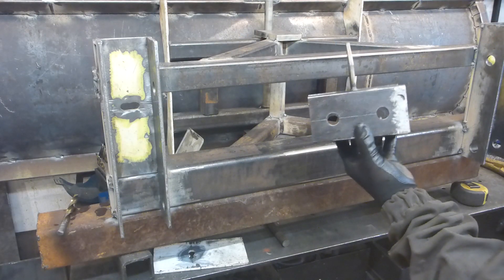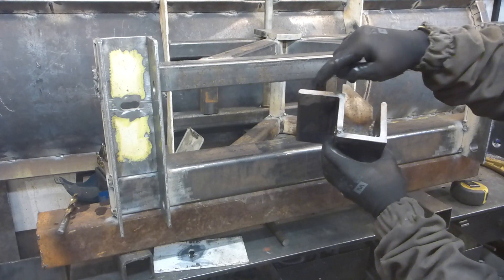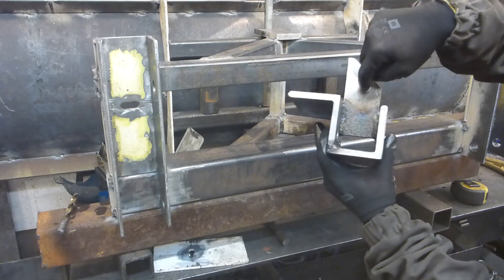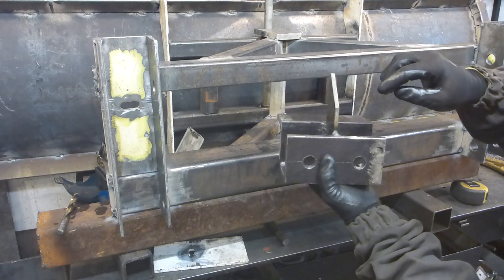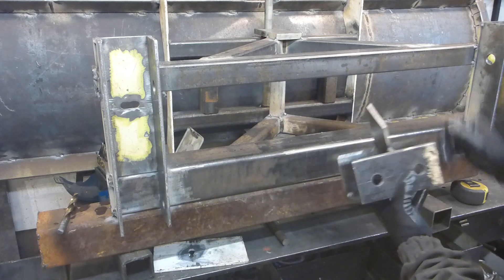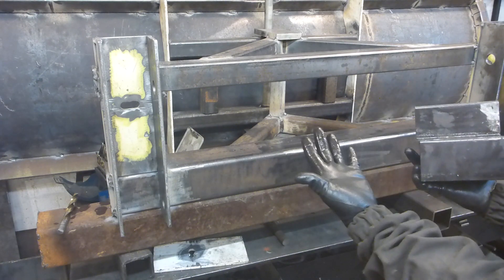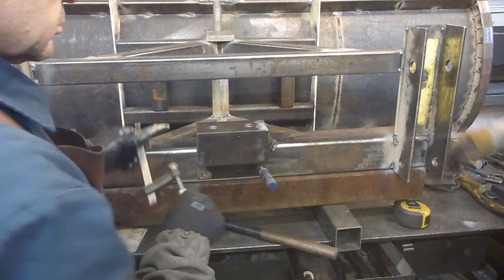So that's the part itself — one piece of angle iron, three by three by three-eighths. Same on the other side being welded here. A small gusset plate, quarter of an inch, and the two holes three by three, quarter of an inch through. There's still oil on it.